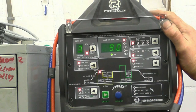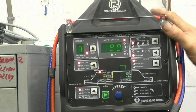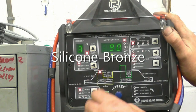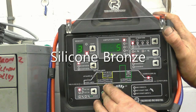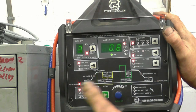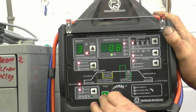These are the settings that I've found to work on aluminium bronze. The welder's got a memory in it and memory number three is the one that I use for aluminium bronze. We'll start at the beginning: gas pre-flow is 0.8 of a second, but I don't need any pre-flow because I'm using the foot pedal — as soon as I press the pedal I get gas.